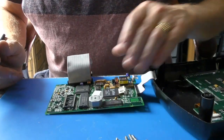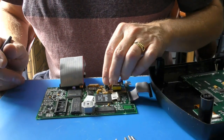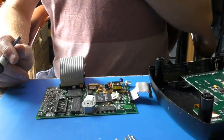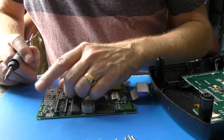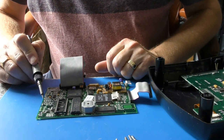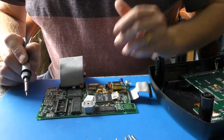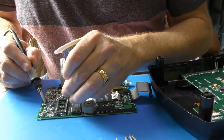So back again with this Seaward Europa plus PAT tester where it's losing the memory. A friend of mine who programs the PIC processors and supplies them for us has said that when the PAT tester is switched off, the battery backup runs the real-time clock. So if this battery isn't working, every time you turn the PAT tester off, say for an hour, then that real-time clock will lose 1 hour. So yeah, that seems to be exactly what's been going on.